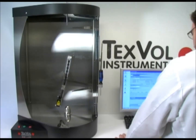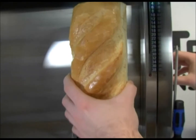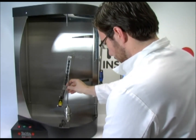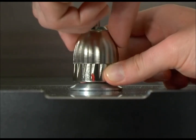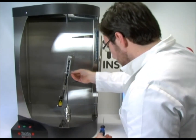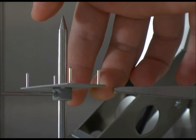The following is how you operate the instrument. Select the product group using the drop-down menu. Select the correct product name profile using the drop-down menu. Centralize the object using the levers. Use the wheel on the side of the instrument to move the levers. Select the appropriate support shaft. Attach the correct attachment in line with the lower lever on the centralization mechanism. This is important as the product will then be centralized in the system.